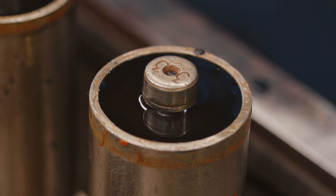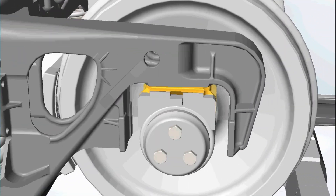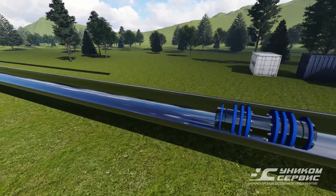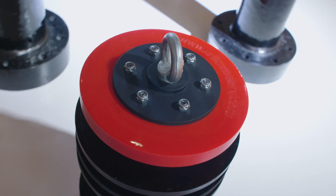Train carriage manufacturing is one of the applications in industries for which we have already manufactured and delivered a number of products. These are products such as inserts and adapters. It is necessary to remove static electricity when the train is moving, which is why we make these products conductive. Another area of application is gas transportation. We install spacers and sleeves made of polyurethane with conductive properties, as static electricity removal is very important for safety. Static electricity also affects and interferes with the operation of equipment.